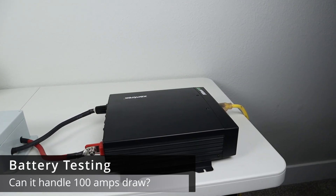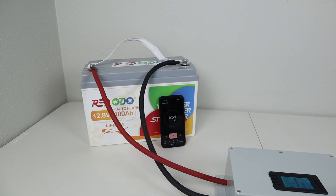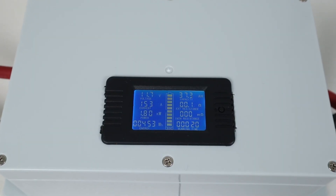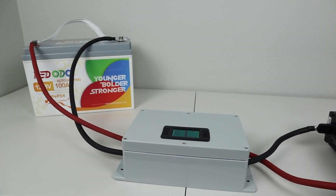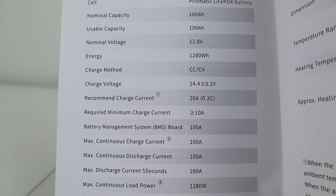The next test was a max load test to see if the battery could handle 100 amps output for 15 minutes without having the BMS turn off. Through my inverter I plugged in a 1200 watt load, right around 100 amps, and let this run for 15 minutes with no issues. I then stepped it up to 150 amps, or right around 1800 watts, and was able to sustain that load for about five minutes without the BMS turning off. This battery does allow you to surge past 100 amps, but going over that level puts extra stress on the cells and reduces charge cycles, so try to keep it at 100 amps or less for the longest lifetime.